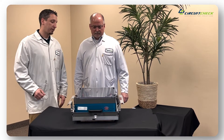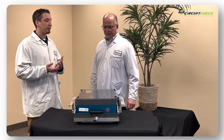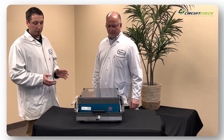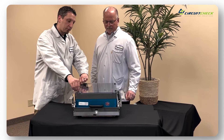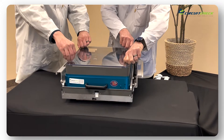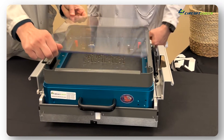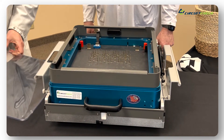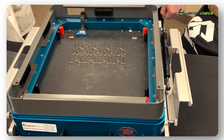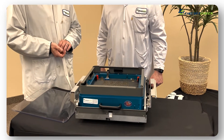Another large benefit that was commonly requested from our customers is: how can I get access to the top side probe for debug purposes? What we have right now in the Vortex series is a rigid belt cover with an insert plate that can be easily removed. Once this insert plate is removed, all receptacle tails, all additional components on top, anything wired into the test fixture can be accessed and debugged while the fixture is still under actuation.